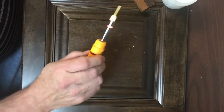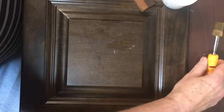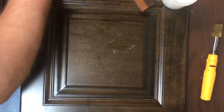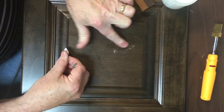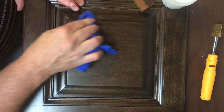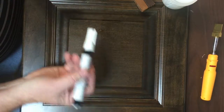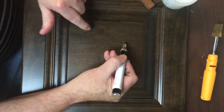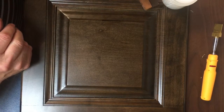That feels real good, so I'm going to go ahead and wipe off my knife blade, turn off the knife, and prop it up out of the way, making sure it's not up against anything that it could damage. Next I'll take a small piece of 400-grit sandpaper and lightly sand that area — it doesn't take much sanding to get it perfectly level. I'll wipe away all of the excess material and excess burn-in lube. Then I'll take one of our felt markers, lightly touch the area, and blend it immediately with my finger — and oftentimes that's all that's necessary to finish up a burn-in.